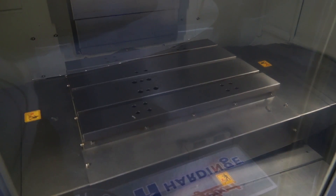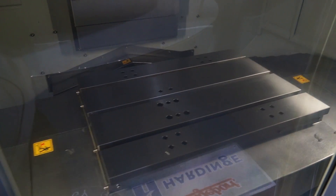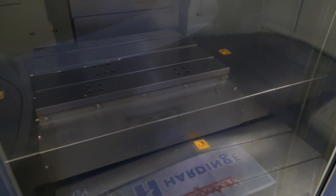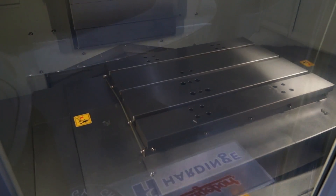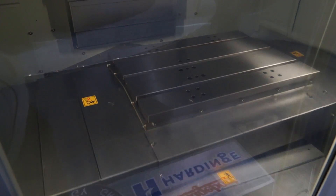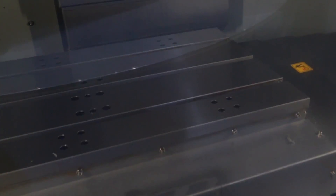I was also going to talk about the linear guideway — so this is a linear machine. Some machines come with box guideways, and there's always the argument about what's better. With linears on this machine, is that a good thing? Yes, it's a faster machine. Gone are the days where we were after a boxway machine that's sluggish taking big depths of cut. Now with our tooling supplies, we're looking at high feed rates, high spindle speeds, and really hitting the component.